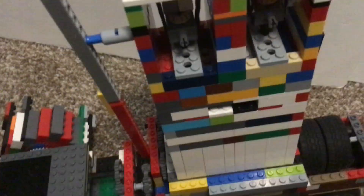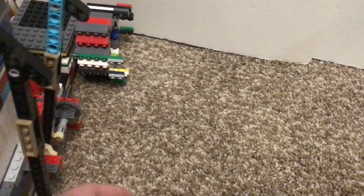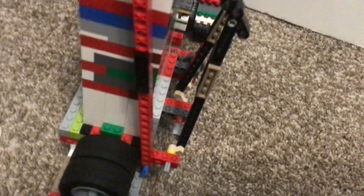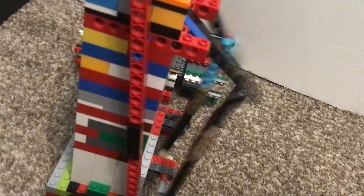How did I get the torque from the motor? This motor doesn't naturally allow much torque, but I made changes. I put in a longer valve travel, so more vacuum goes into the cylinder, which has more vacuum to suck up the piston. That helps, but it doesn't increase speed because it has to push more valve spring — so it actually slows down but has more torque, since it pulls the piston up farther. The increased valve spring resistance limits speed but gains torque. That's how I got the torque out of that engine.